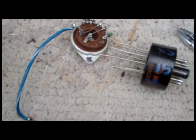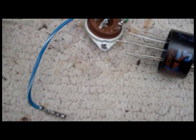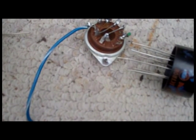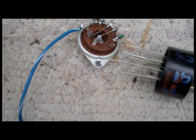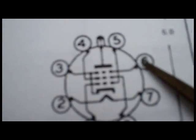Now it's time to figure out and hook these together — what pin matches what. This blue wire I left on goes to the cathode of the 6JE6. This socket is out of a Packard Bell that had a removable cathode current test adapter, and I'm going to leave that on so I can check the cathode current easily. I'm ending up with all these pins bridged here, the same as how this is bridged to there. I'll do it on both sides so there are never any problems.